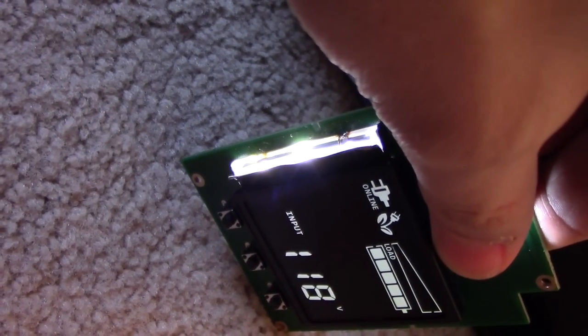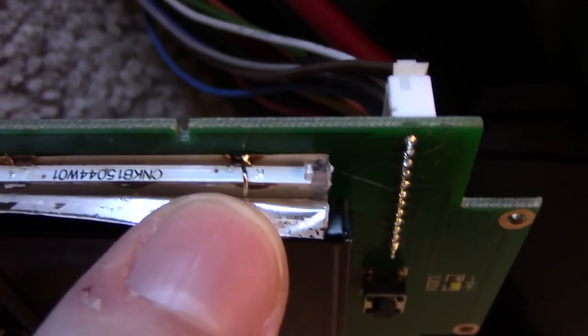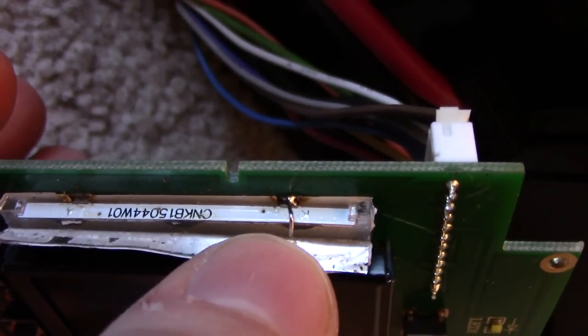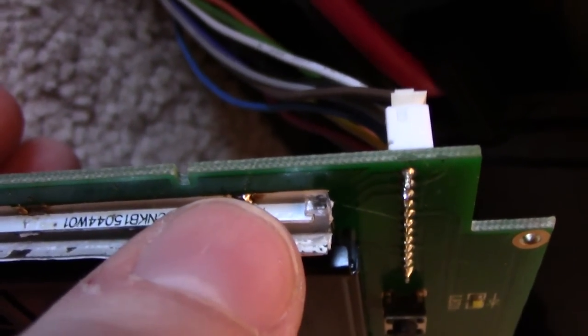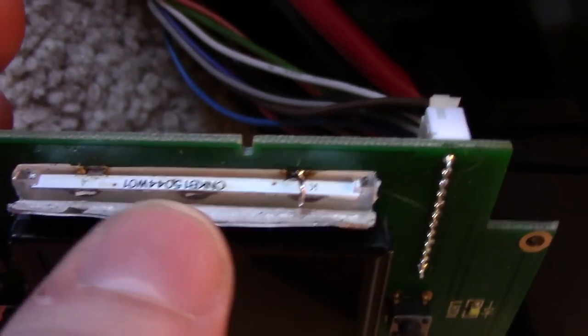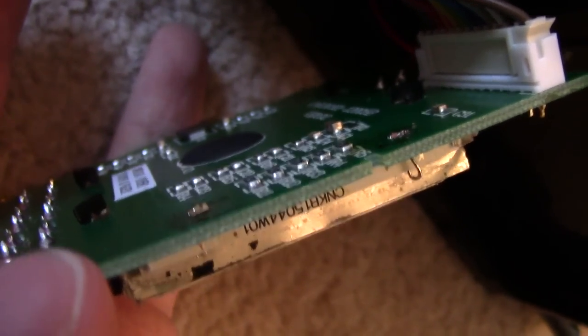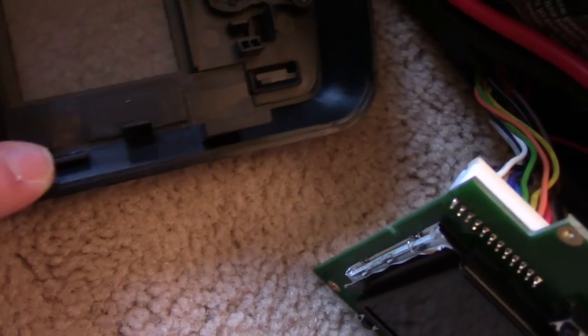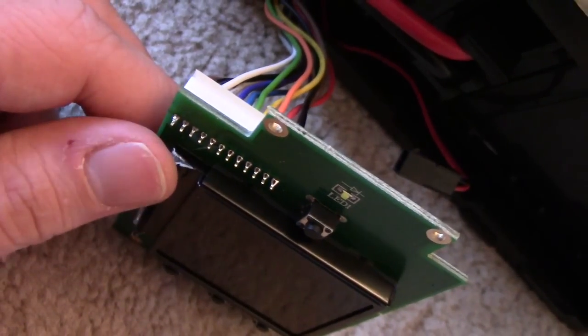You have to hold the power button for quite a while for it to actually shut down. Unfortunately, this board is pretty terrible. I actually had to build my own lead on this side — I found it was easier to just cut off the tab of this board and put a random piece of wire from one of the pads of this LED down to the pad on the other side. Even though it's a plated through-hole, because it's plated I just have to basically make contact with the pad on this side, and this tab survived so it's connected through on this side. I'm just going to basically tape all this back up, and you don't even really have to do that because the case itself is not transparent. The only thing you're really trying to protect against is light leaking around this window here — a little bit of electrical tape will seal that up nicely.